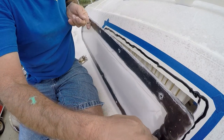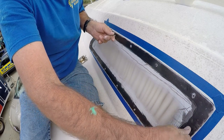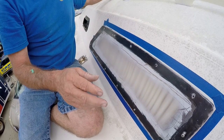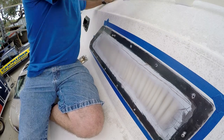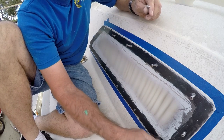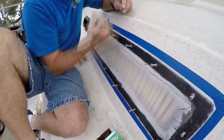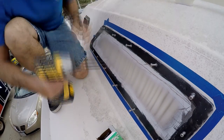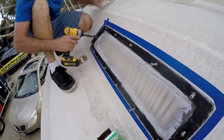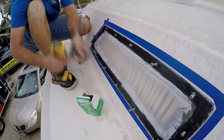This is the careful part. Use a couple of screws as a guide to fit into the holes. You've got to do this fairly quickly — this stuff dries pretty fast. Tighten down with even pressure. Do not over-tighten. Plexiglass will crack pretty easily.